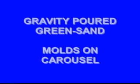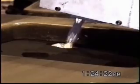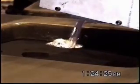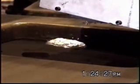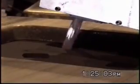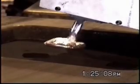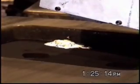The pump is not limited to low-pressure casting techniques, as can be seen here, where the pump is used to gravity pour into horizontally parted green sand molds on a turntable. Shown is an 18.6-pound casting being poured. Pumping starts immediately after the carousel is locked into position, and after the end of the pour — about nine seconds later — the pump control system permits carousel indexing. As soon as the next mold is loaded, the carousel indexes and the next mold is filled. For this casting, the total cycle time would be about 12 seconds per mold, so the production rate could be as high as 300 molds per hour.